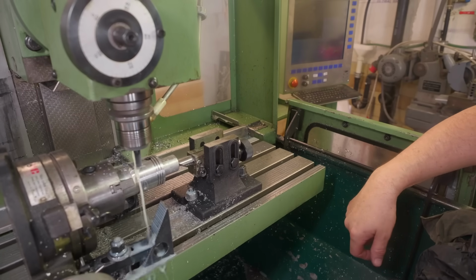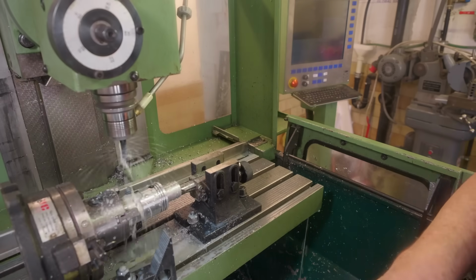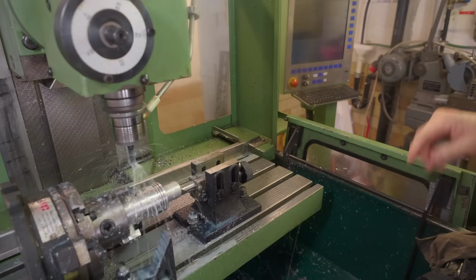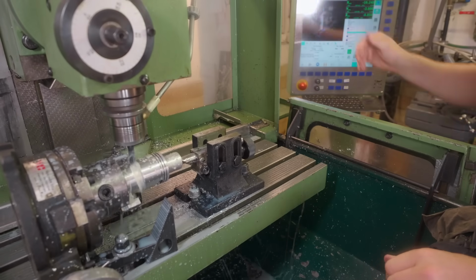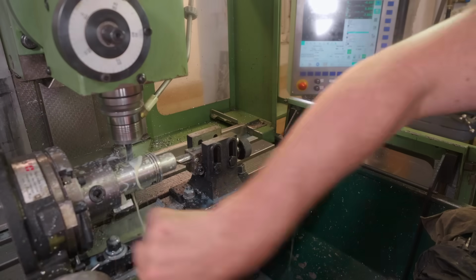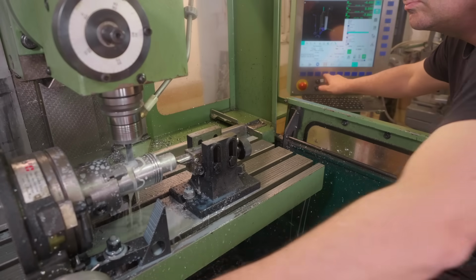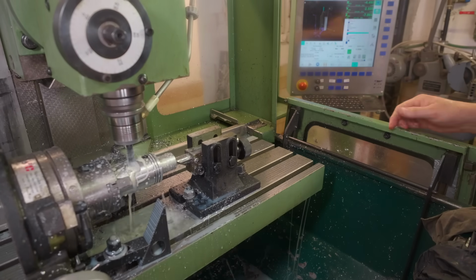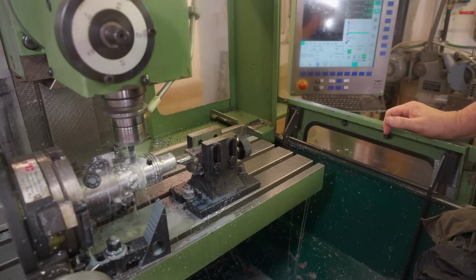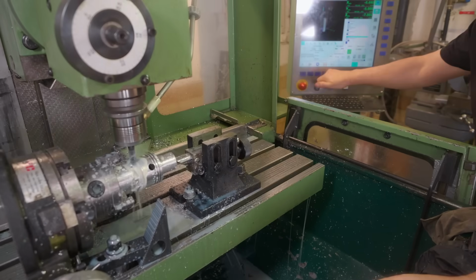So for this toolpath, first I do a clearing cut to get rid of most of the waste that I don't need. While it's on M1 stop, I index my rotary table around by 55 degrees, unpause it, it goes down, cuts the radius corner, goes up to the inner corner of the cutout, pauses again. I start indexing around to 55 degrees in the other direction. As I go through the center, I unpause it so that the tool can move from +5 to -5. 10mm tool. Then it continues to the far end and cuts the radiuses on the other side.